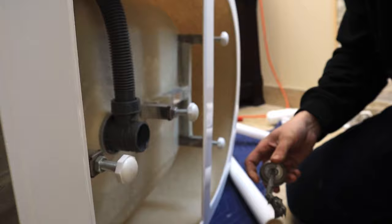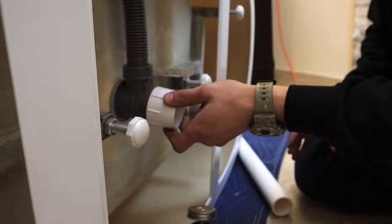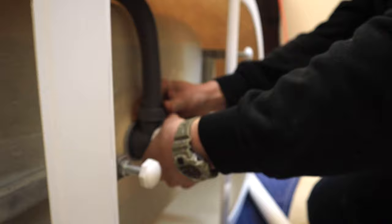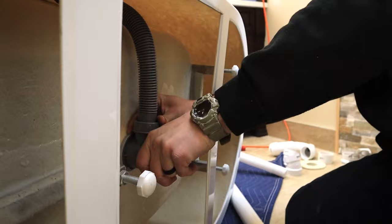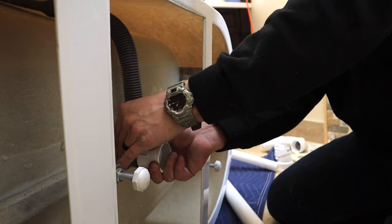Put the pro dope on like frosting on a cookie — just gook it up. The fitting slides right over that nice and tight. Hand tight will be okay. Make sure this is nice and tight — that's your overflow valve, the overflow coming from the tub.